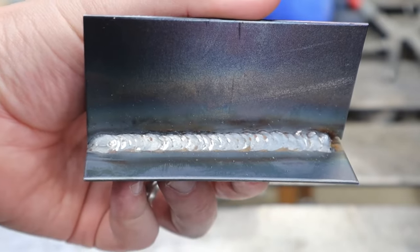I've got some 1/16th inch coupons. These were just the suggested settings, and to me it sounds like the wire speed is a bit too low. The weld actually didn't look too bad, but it was sputtering a little more than I think it should have. Kicking it up to eighth inch material, doing the same fillet weld on a T-joint.